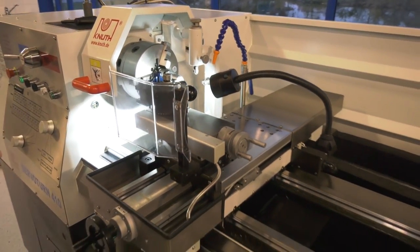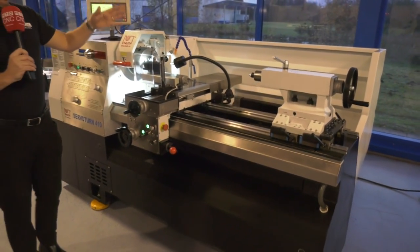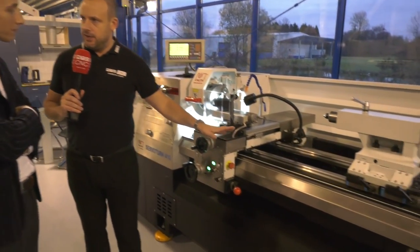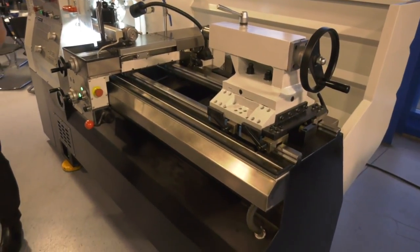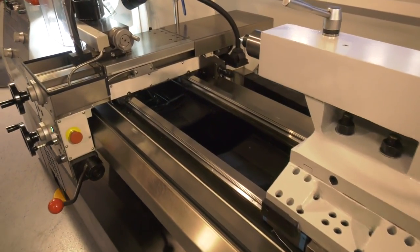This is a small machine — this one — but I know the range goes far bigger. This is mineral casting on this bed. Now I want to learn about this. Why have you chosen this as the foundation of the machine? Well, our studies show that mineral casting has six times better damping capacity than standard grey iron.